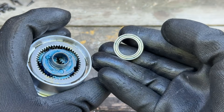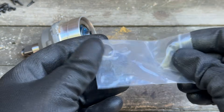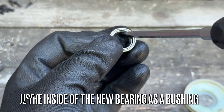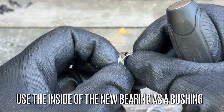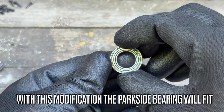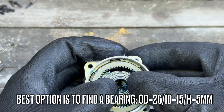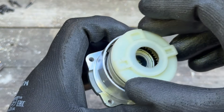In terms of a new bearing, it's very difficult to find the correct size. So I ordered one that had the correct inside diameter. Alternatively, you can just get a bushing and cut it down to size. Links to the bearing I'm using and to the bushing option are down in the video description. Because there are so many separate parts, it's best to use some sort of adhesive between the bearing and the new bushing.